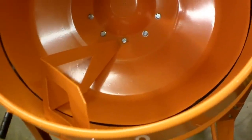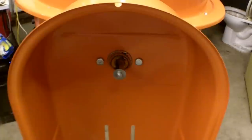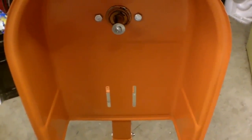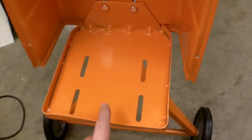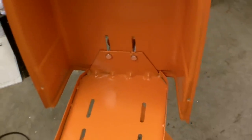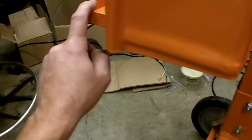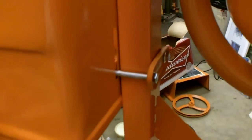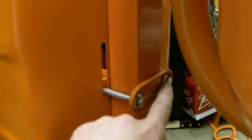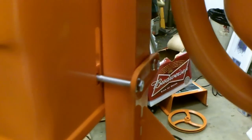Installing the motor hood using the remaining fasteners from bag four — two bolts, two washers, two nuts, done. Now installing the motor bracket using all fasteners from bag six. I left the motor bracket bolts loose intentionally, because that's the adjustment point for belt tension. There's also a secondary bracket that's not clearly referenced in the bag list, but you'll find it — it goes right here with nuts and washers.